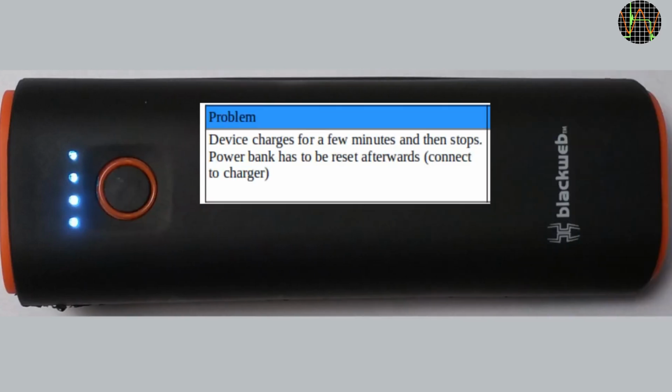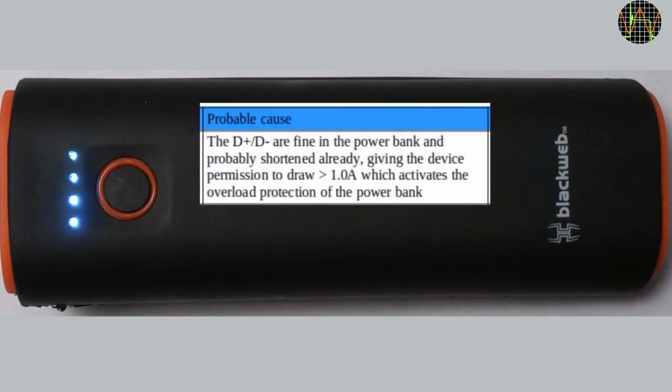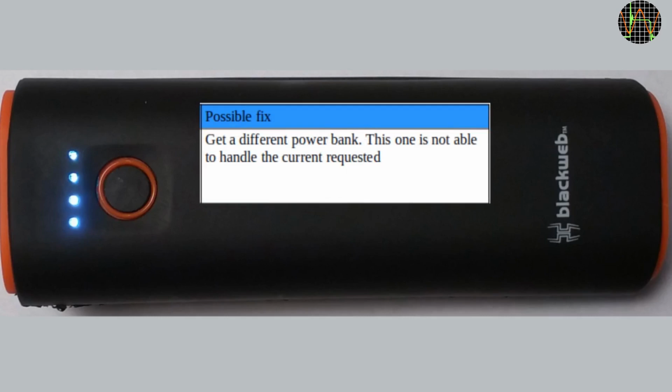The second problem is basically what you saw after I had fixed my power bank. The A40 charges for a minute and then trips the overload protection and doesn't get charged at all. The telltale clue is whether the power bank still powers on afterwards or needs to be first connected to be charged to reset the protection. We discussed this already. Basically, the reason is that the device draws more than 1 amp of charge current. Unfortunately, in that case, the only feasible solution I can see is to get another power bank that can handle more current. And on that cheery note, thanks for watching.